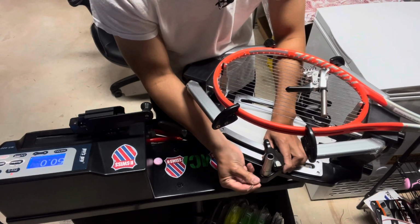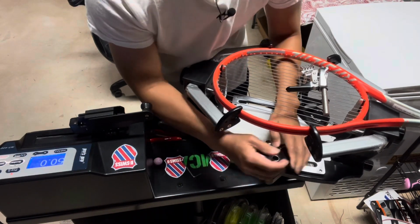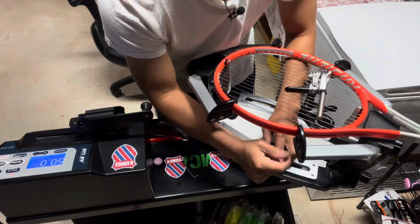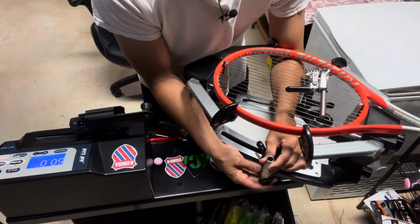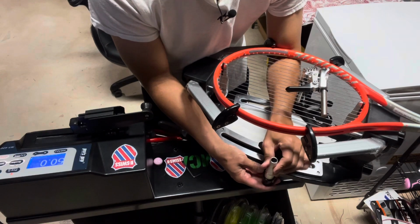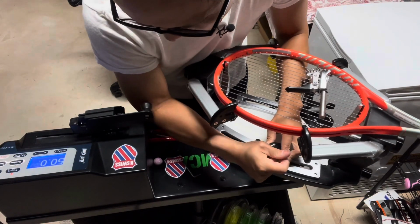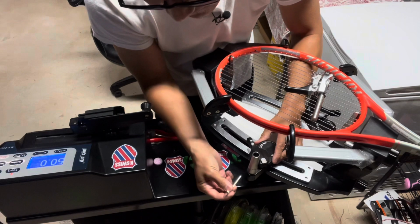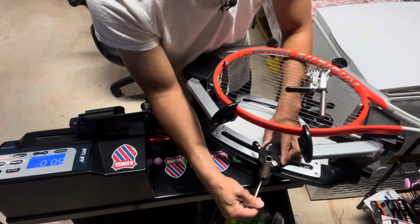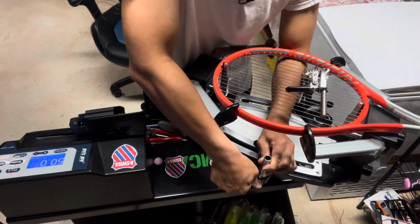Once it's all the way out like this, I can peek through the hole and see that there are actually threads. That's how this post gets screwed on. Right now it's on there tight. Okay, see, I just unscrewed it, now it's loose. See how it's loose? What happened was it wasn't fully screwed on 100% all the way. So what I did was I made sure that it's on there tight, fully seated. And before I replace the set screw, I make sure I absolutely torque it down so it has no room for movement.